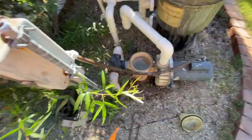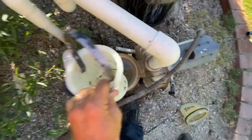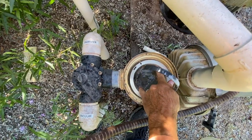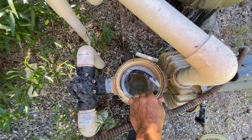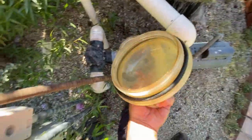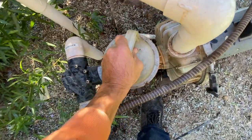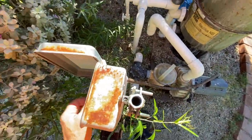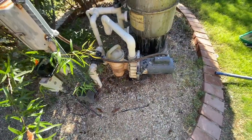Once you've done that, I do a quick empty of my pump basket. I seat it back in making sure it fits in properly — notice this little notch right there. This is a Pentair or PacFab type of pump. Slide it in and make sure it's in place, then take the pump lid — again making sure the o-ring is in place — and snug it back down. Don't over-tighten this, just make it snug. Then turn the pump back on via the override switch and the time clock, and it will prime and we are back in business.